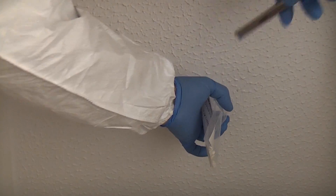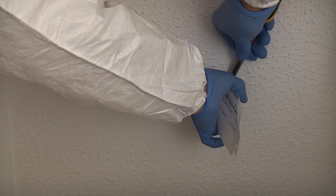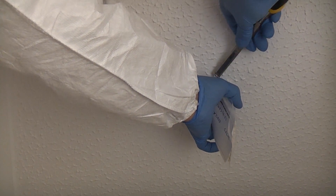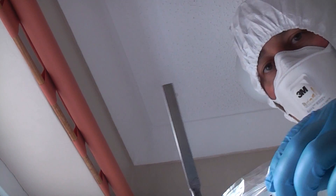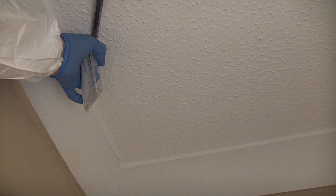To start off with we need to spray the area using the water spray — this will keep the dust to a minimum. I'm now going to ensure I've got the correct bag for the area, that it is labelled correctly, and I'm just going to scrape off some of the textured ceiling. It is important that you catch all of the debris in the bag. You're better off doing this when the house is empty — you don't want to be doing it when there are other people around.